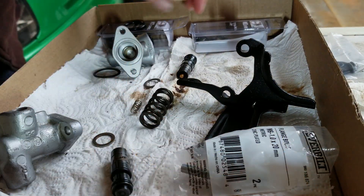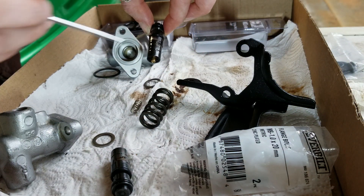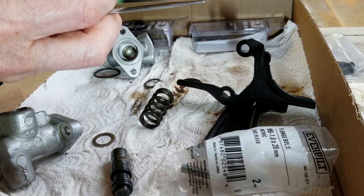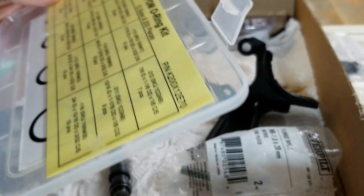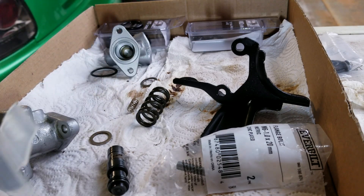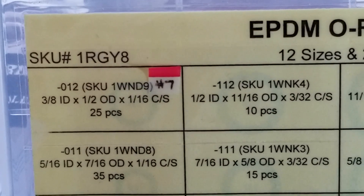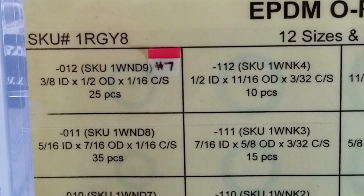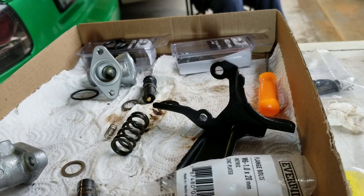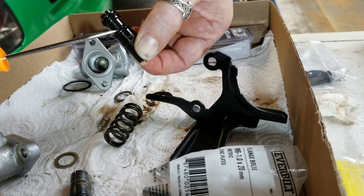Just to review, this is the valve that comes out. There's one on either side as you see here — this one goes here, this one goes here. The O-rings we used: I used this one that's the equivalent to the Danco number seven. All of its dimensions matched. It's this EPDM O-ring, and it is this guy right here.